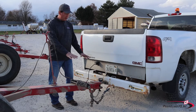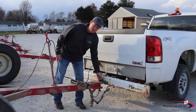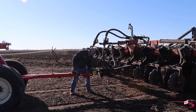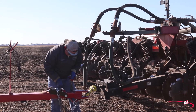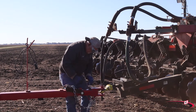There are critical parts to be aware of when hooking up. First, we need to have a good solid hitch pin — not bolts or railroad spikes or things like that. Make sure we've got a good solid hitch pin, and on the bottom of it make sure there's a good clip or a keeper pin to hold that hitch pin in.